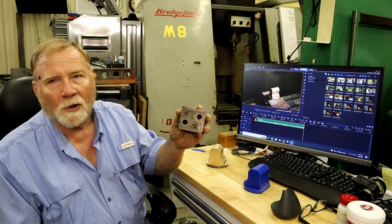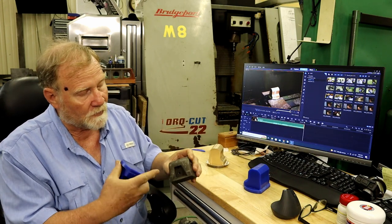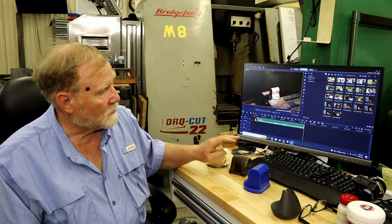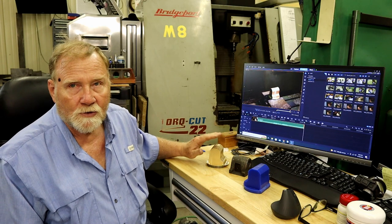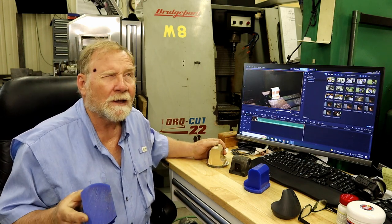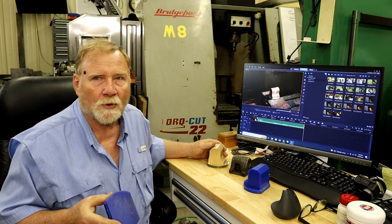We'll have to put a couple holes in the bottom of them so it bolts up. Got to mill this little pocket for the oil into the side of them. We'll probably just only do that on this one. These two mainly I wanted so I could practice my left-hand Acme threading, which I haven't done in 20 years.